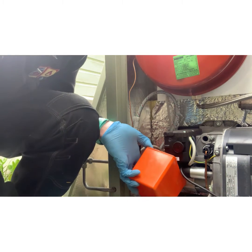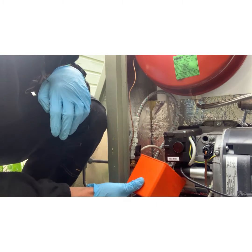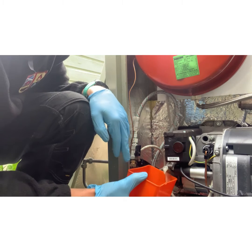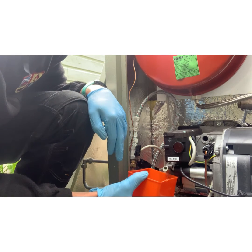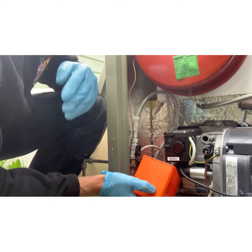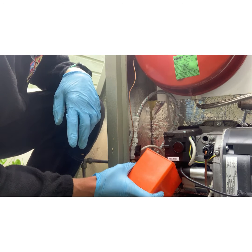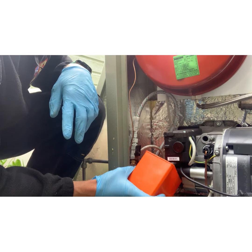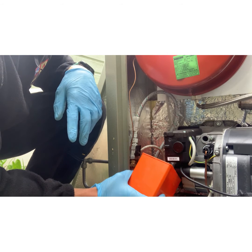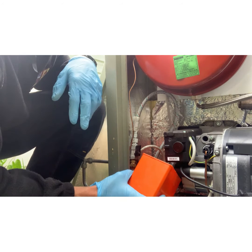I'll just keep the pump pumping. Now we're just bubbling away there as you can see — we need to get rid of all the air until it's running pure oil into the tub, or else it'll just keep on cutting out. This can take a bit of time depending on how far the oil tank is from the burner.